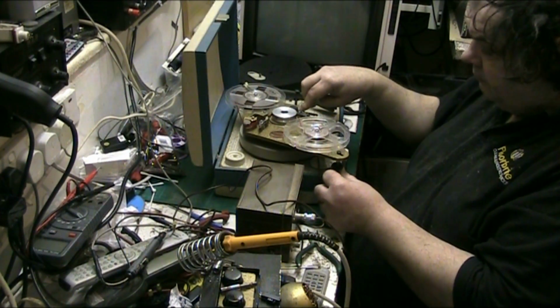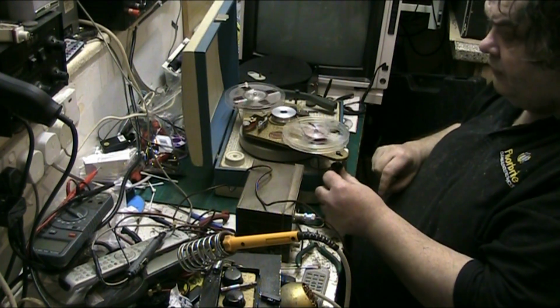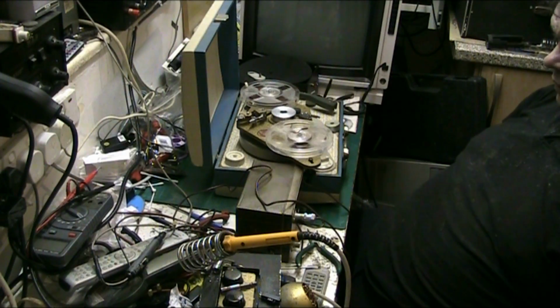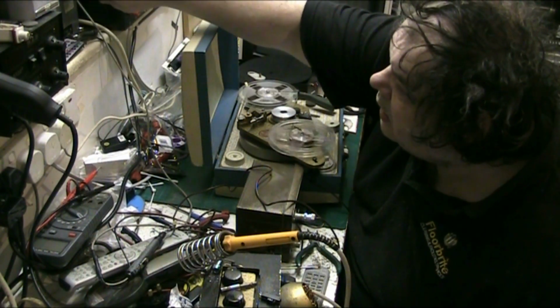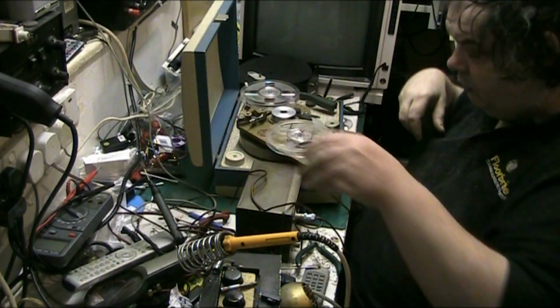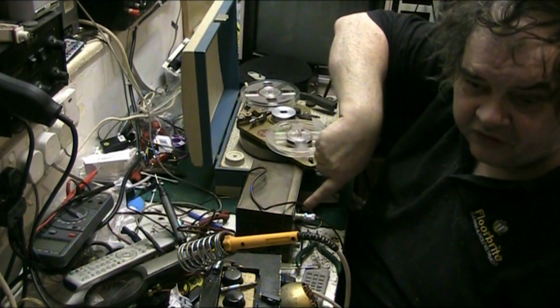And then what you do, you press that, which engages your pinch roller. And then because we want to use 45, you put on 45, and I'll hold that. Well, I can actually let it rest there, it should be alright. Turn the signal tracer up a little bit and wait for the sound. Oh, that was why. Why are we getting no sound? We'll have to turn the Gramdeck on, put it into play on the controller.